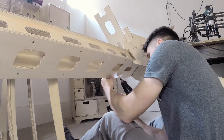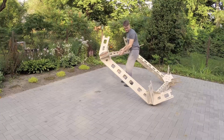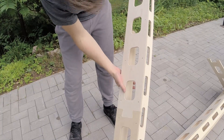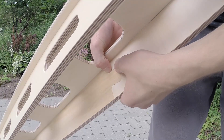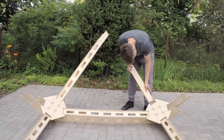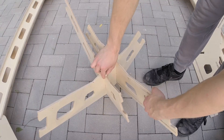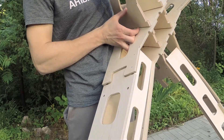I finished adding the screws to the frame and realized I wouldn't be able to assemble the whole project in my workshop, so I took the frame outside and rolled the workbench with all the parts next to the project. I had the foundation and it was time to build the frame upwards. I started by assembling one of the triangle edges, inserting the edge supports into the corner component grooves, and securing them with screws. When the first edge was in place I assembled the other one, again securing each component with screws. The most challenging part was installing the corner components — it was difficult to fit the edge reinforcements into grooves and join the corner parts with the frame side component.